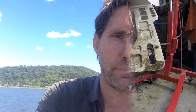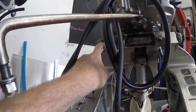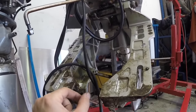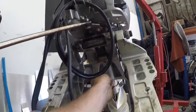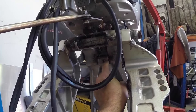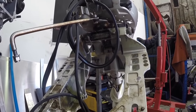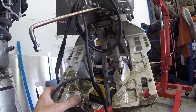So we'll get to it. Hopefully if you're having this problem it'll give you some ideas about how to clean it up and make sure it doesn't happen again. Just to give you a quick heads up on how this trim tilt got removed: I backed off the nuts on the steering pivot tube, which allowed me to separate these far enough to pull the pins out. Up here the top connects, and once the base was free I could rotate the whole mechanism until it came out. That's all that was involved in removing the whole trim tilt mechanism — and obviously the wires heading up towards the relay.